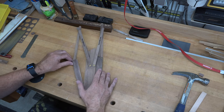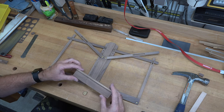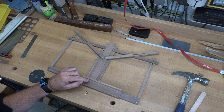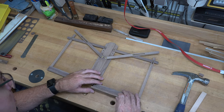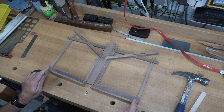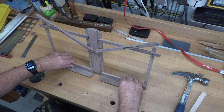If you've followed along so far you should have a cool folding music stand, but we need to add that bottom lip so our music won't fall off. I've taken a piece of walnut — a scrap three-quarter inch piece — cut it to be an inch and a half wide and seven and a quarter inches long. I've cut a rabbet in it that's half an inch by one and a quarter, and I've made two of these. They will glue right in here, one on each side, even with the end of our bottom rail. I'm going to round off the sharp corners and then glue them in place so our music has a shelf to sit on.